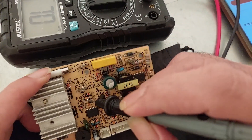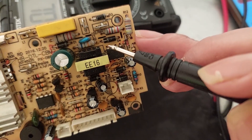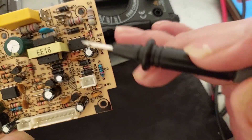I already tested all the resistors. There is no problem with the values — no declining value under 50 percent and no open lines. That means all the resistors are still good.